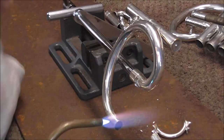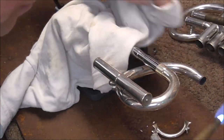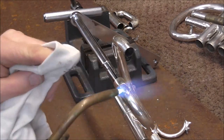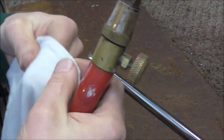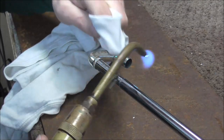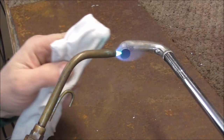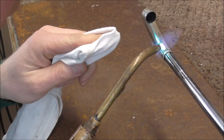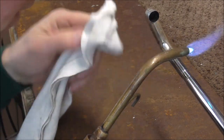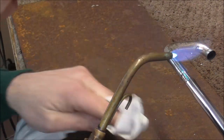You need to get all of the solder off that's anywhere near there. I'm going to first heat and wipe it — that takes off most of the solder — and then after that, I'm going to buff it out, which will take off the rest. When I buff, I'm going to need to be very careful not to remove any of the silver plating. To heat and wipe, I take a t-shirt type material, put it around my finger, heat it up to 450 degrees Fahrenheit, and then as soon as it melts, I take away the flame and brush away the solder. That takes the solder down to only a few atoms thick, so it buffs off easily. If you don't get the solder off all the way, then you have to do a lot more buffing, and the buffing can ruin the silver plating.